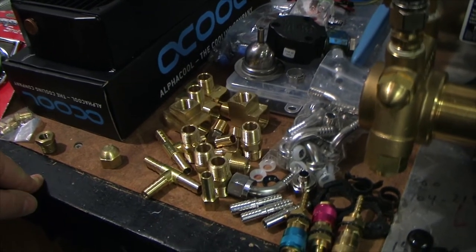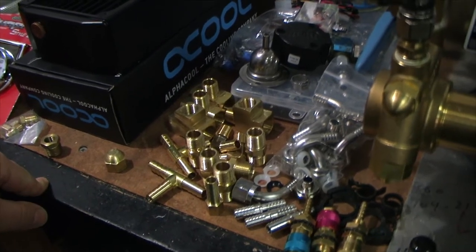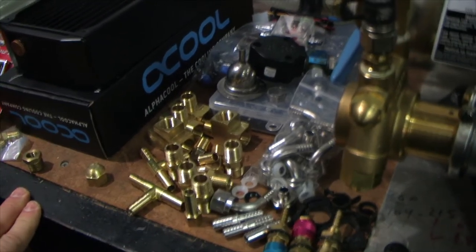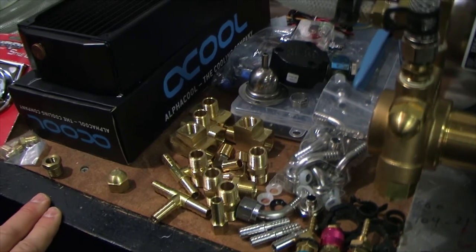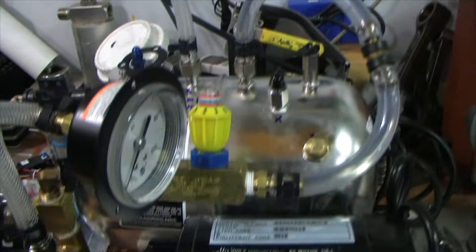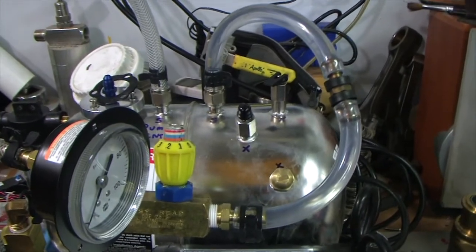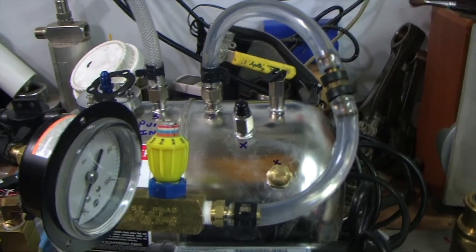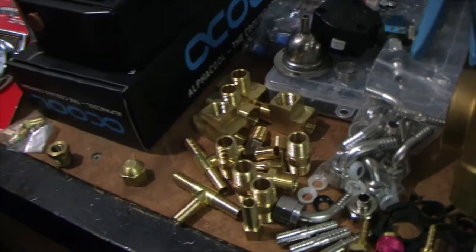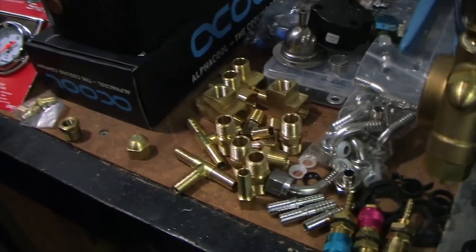For fittings: if you get an automotive gauge, make sure it has all the pipe thread adapters you need — typically 1/8 pipe and 1/4 pipe. You'll also need an adapter since everything is 3/8. One thing to really remember is that most of the fittings here are plumbing 45-degree style flared fittings — they're not the same as AN fittings, which are 37-degree. If you cross those, they're all going to leak. Stick with gas line or brass plumbing fittings — they're all 45-degree.